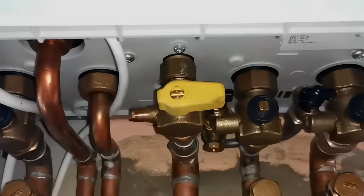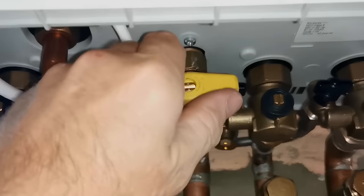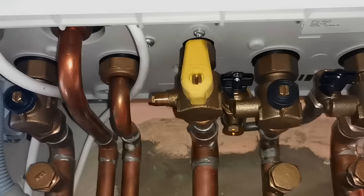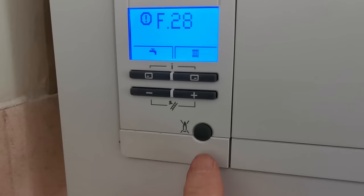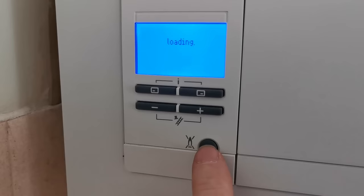You can also locate your gas meter and make sure that the emergency shut off handle hasn't accidentally been knocked off. If you have a prepayment meter, also make sure that the credit hasn't run out. There is one other place I will check — underneath the boiler. I've only come across it once but there was a case where this valve had been shut, and all you've got to do is make sure it's in line with the pipe. After you've checked that your gas is actually turned on, you can go back to the boiler and check it again for operation. If it just goes back to lockout then all you can try is pressing the reset again, and if that doesn't work you're probably going to have to call an engineer.